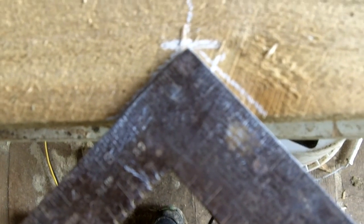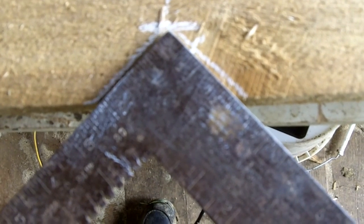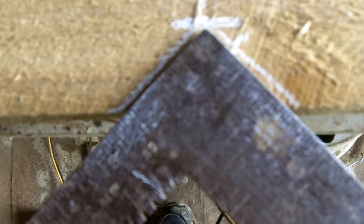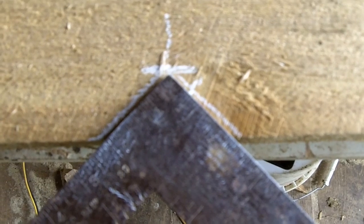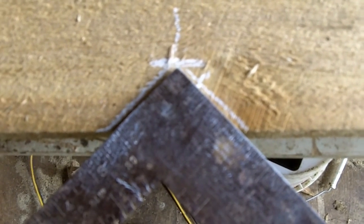It's pretty hard to do this by myself, but what I've done is I've used my framing square, and I used a little chalk so that the marks that are actually incised in this very special square can be visible. And by being about 2 there and 2 there, I've got a 45. And you might say, yeah, but you use chalk, you're so far from the square. I know, but when I make my cut, I'll allow for that. I'll run the saw well inside those chalk marks.